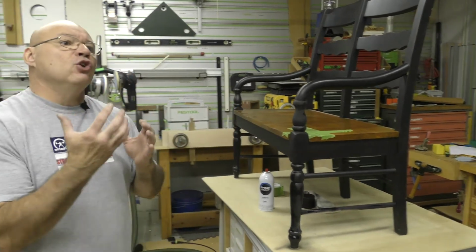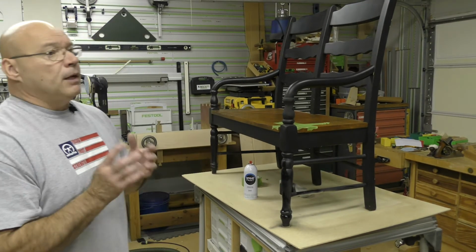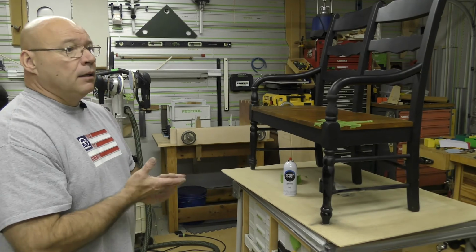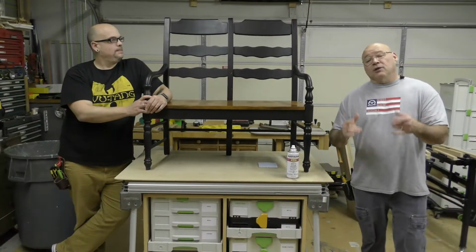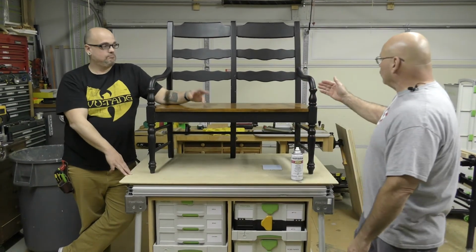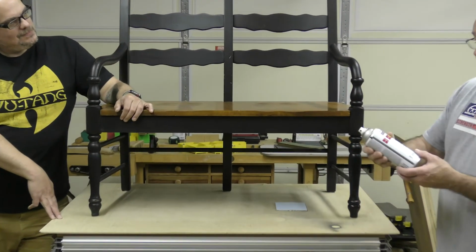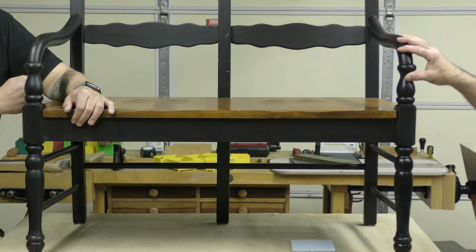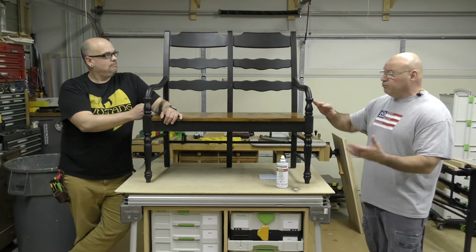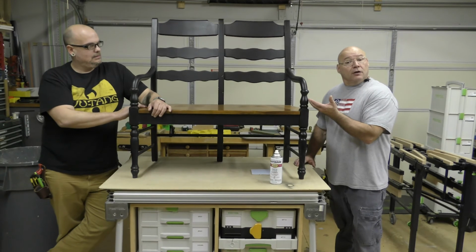If it's a noticeable difference, I didn't do it on this rung here, maybe I'll just spray some quick clear satin lacquer and then blend it in with some steel wool. So, a quick wrap. You can see where this was the original. This is what was all chewed up. We'll get a close-up shot of this. We shot the black spray paint on here, and then I finished up with this matte clear enamel. And you pretty much can't tell the difference between the original and the chewed up one.